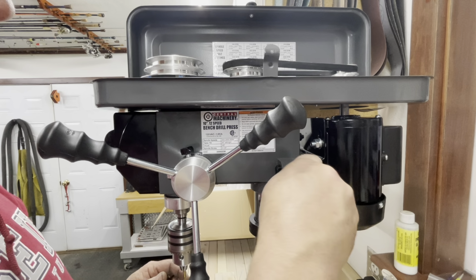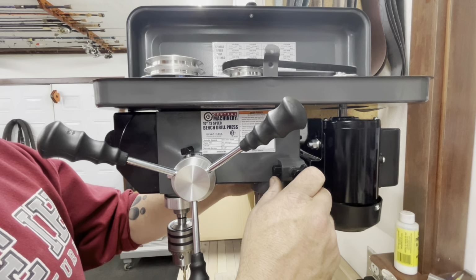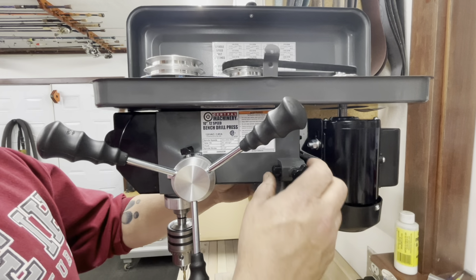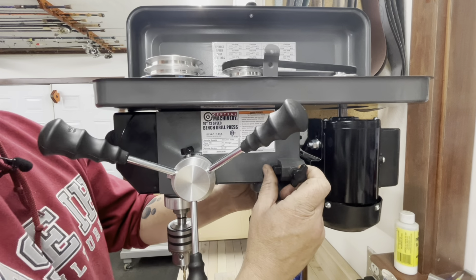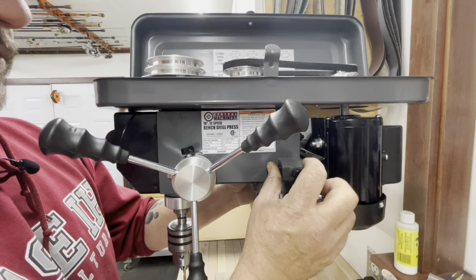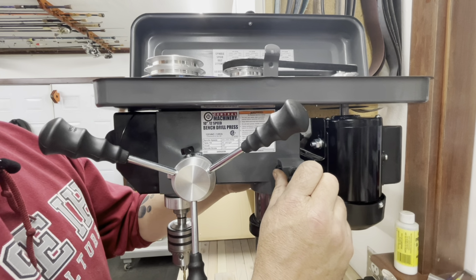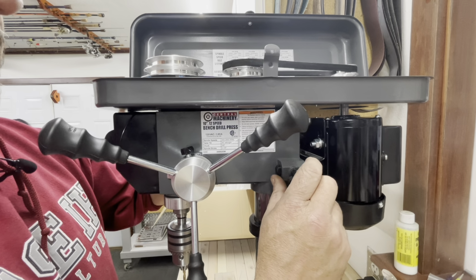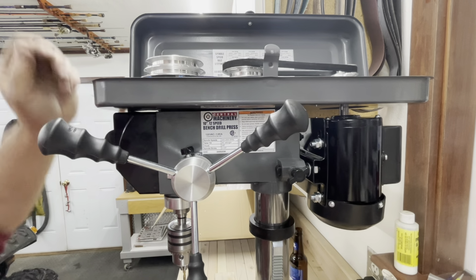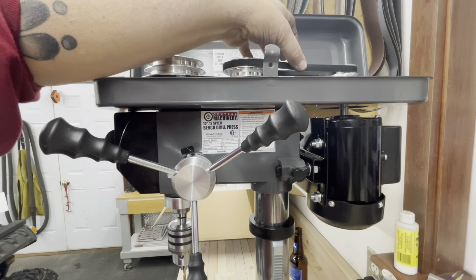All you do is spin these wing nuts out and loosen these up, and you do it on both sides, and you can see there the motor moved. And then to set it, I just put my thumbs on here and push it, and then use your fingers to snug up those wing nuts. And you do that on both sides. There's one on the right and the left. The deflection on this, they say reasonable thumb pressure should be able to deflect at 1/2 inch.